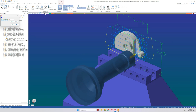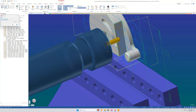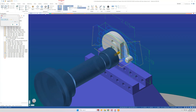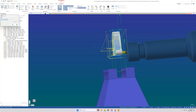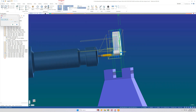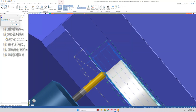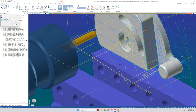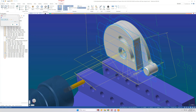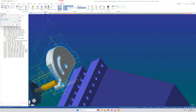This is an eighth inch end mill, and I didn't fuss too much with getting the correct diameter because this is a low-run part. I just stuck with the eighth inch end mill for all the internal features — the arcing pocket, the little circle pockets on the back and front, and even a circle pocket for the tapping operation. Then here's the ball end mill that does the finishing. You can zoom in pretty close to see how the ball is actually profiling the radius — pretty cool to see in action — and again making sure you don't crash into your fixture.